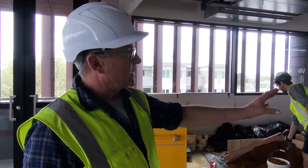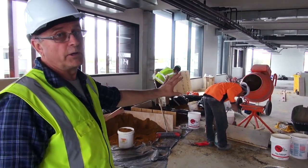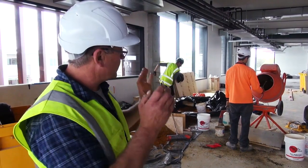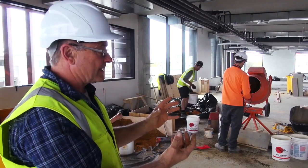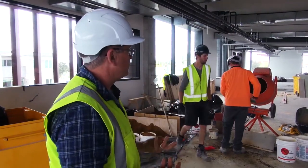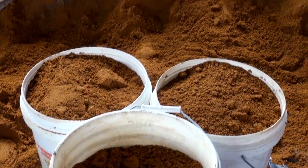What we're doing here is we've got basically a plaster mixer, and we've slightly modified the paddles inside so that we don't get any rolling and balling in our mix — it's just rammed earth. You'll see what Zach's doing here: unlike concrete where we can just put the water in, the water has to be sprayed in as a fine mist so that it gets around all of the particles of soil, rather than dumping it in like concrete where the water takes the cement right through the mix. Ideally the soil is about the right moisture content before you start, then we don't have to modify it much.